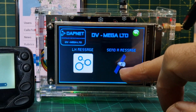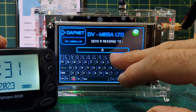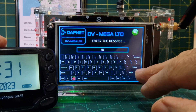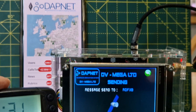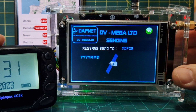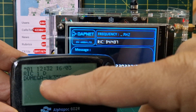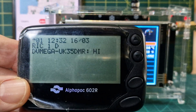Now let's send a message using the actual hotspot. Tap the screen, tap DAPnet, then go to send a message. Enter the call sign M0FXB, type a message — I'll just say 'hi' — and click enter. It's now sending via the DAPnet system through my hotspot. Remember, a pager is a receive-only device, so with a bit of luck it will beep.